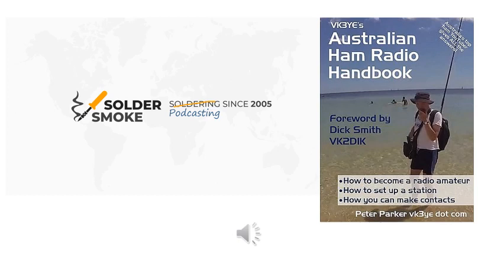I remember when I built my first SSB transmitter based on a design by Frank Lee — G3YE, very active in the GQRP club who wrote many articles for Sprat magazine. I needed to align it but didn't have any test gear out in the Azores. I was in regular contact with a friend in Sweden, SM4FQW. One night we got on and just with me with a little screwdriver on the carrier oscillator, we aligned it by ear — we might have also been on Echolink simultaneously in case we lost it on the air. We lined it up quite nicely.